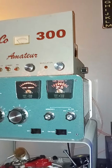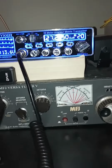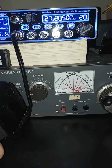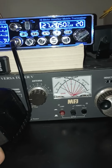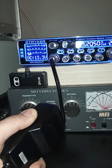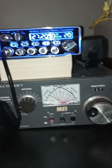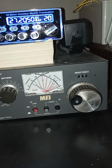So, do you operate without preamp? Up. Oh. See where we're at now. Remember, we had no carrier before. Now I have a 30 watt PEP carrier. And like a 1.5, so definitely got to fix that input tune. We'll get there, but I'm putting out 4 watts, so I'm not too afraid of hurting anything at the moment. Let's see what we can swing to.